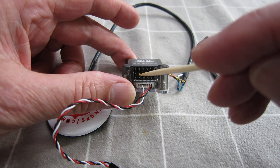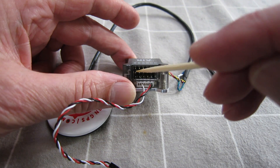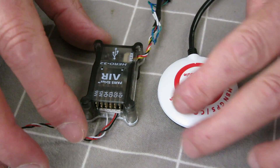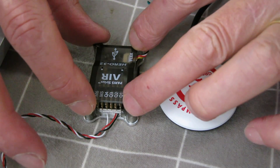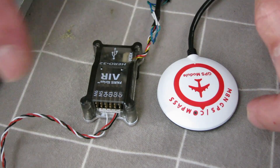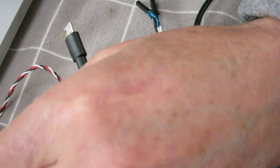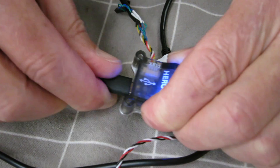The designer decided that M5 and M6 pins are more useful as on-screen display pins, so you can plug in an external OSD using those two pins. The good thing about this board is that it comes with all the connectors connected — compass included — in a gel-damped mount board. It's all done for you and it's pre-configured with a fixed-wing configuration, so it takes care of a lot of the initial setup. You're going to need a micro USB plug to connect it to a port on your computer.